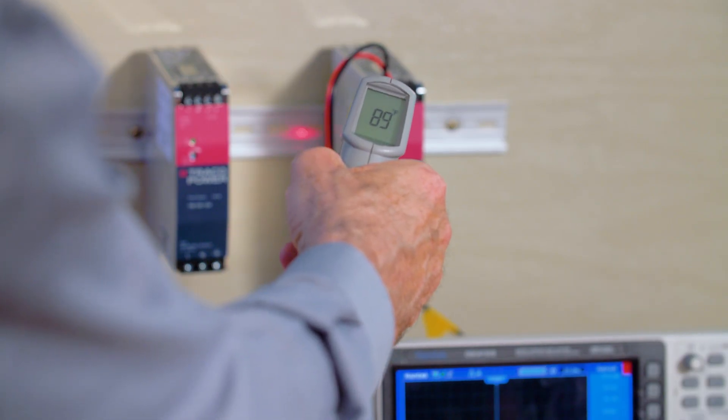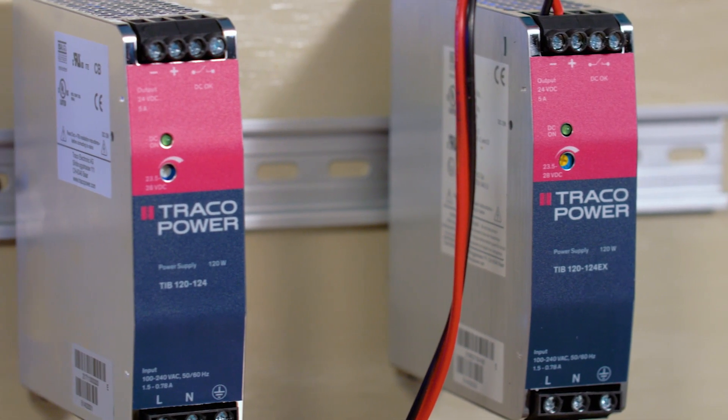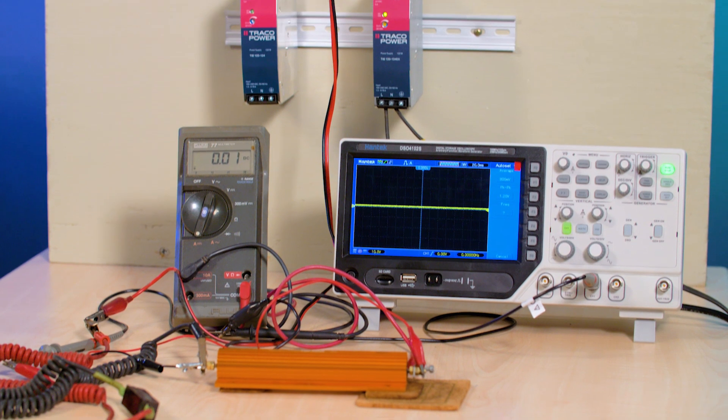That's the advantage of high efficiency. These supplies can also supply 150 percent of their peak power for up to 4 seconds, a feature that comes in handy for inductive loads such as solenoids or stepper motors. And they have a back power immunity feature that prevents the supply from malfunctioning when decelerating motors or other inductive loads feed power back to the supply.